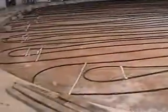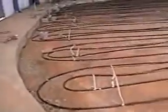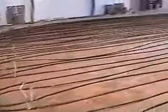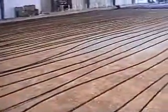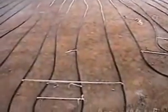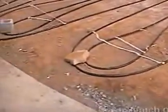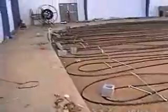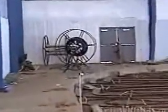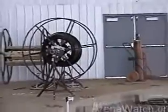Here we show the subsoil heat tubing being finished. Essentially, this is a 3/4 inch polyethylene tubing located 18 inches on center over the entire rink. We have a more detailed subsoil heat video and complete floor installation video that's also available through BRS that gets into the details of the components and the installation methods of the tubing. The tubing comes in large spools, 2 continuous runs to minimize the amount of joints in the floor as much as possible.